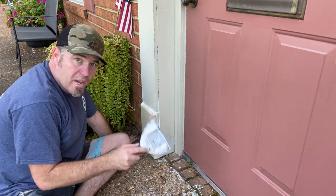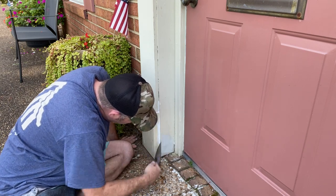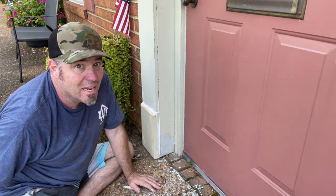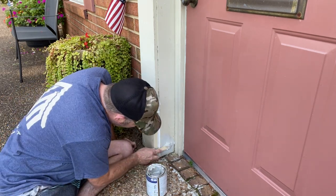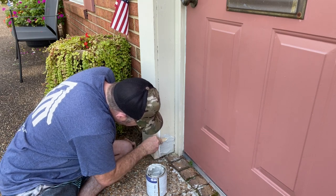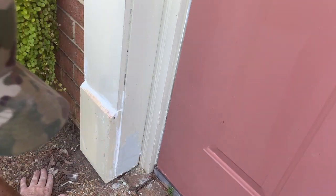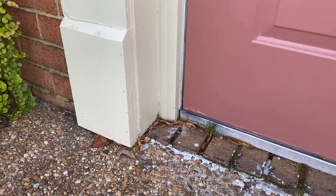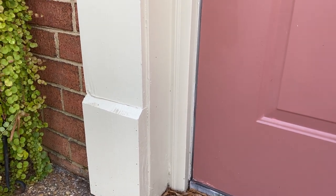This time I'm gonna put the finish coat on with a nice smooth knife instead of a stir stick. I'm gonna go ahead and put our second coat on there — just smooth it on like so. Now do your finish coat. Smooth. Now that's looking sweet. It's seamless — well, there is a seam there, but we hit it really well, and even without sanding it, it looks pretty amazing as is.